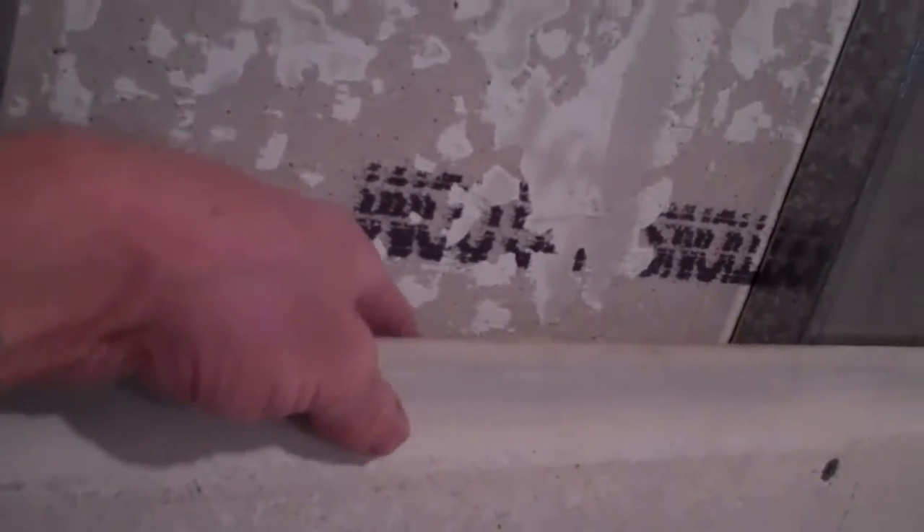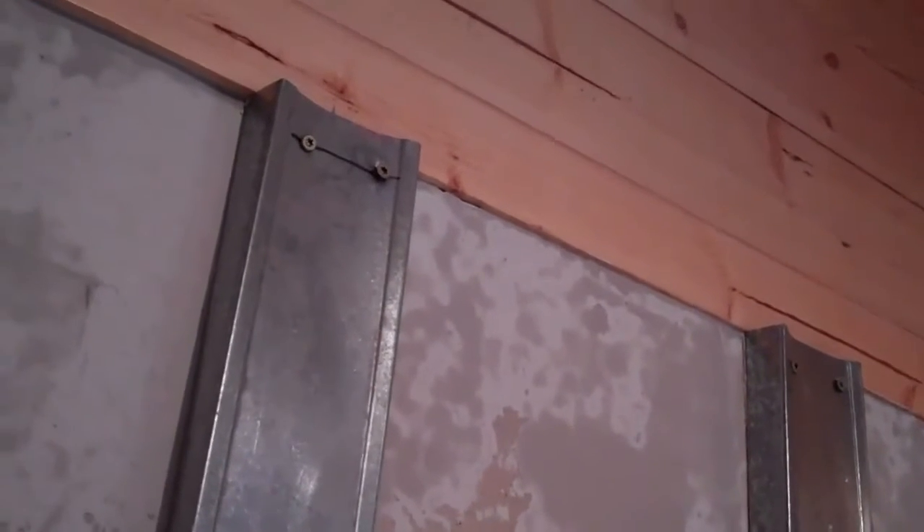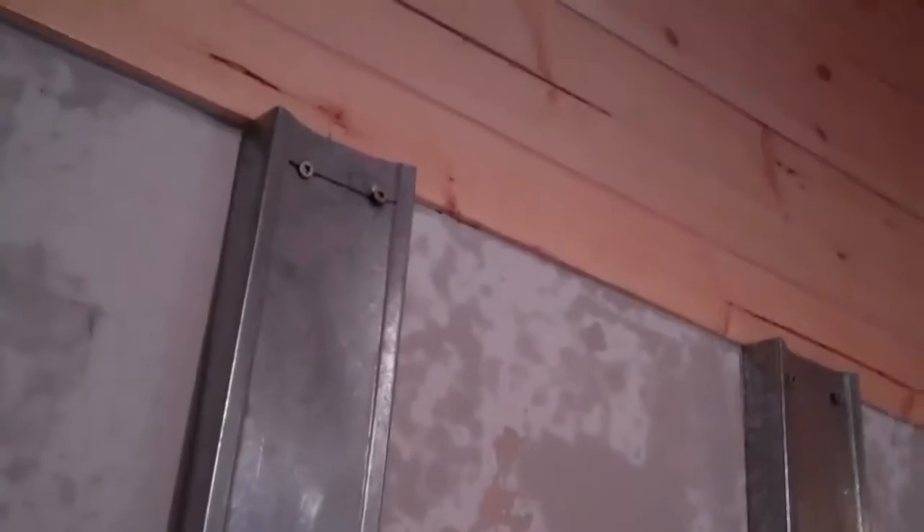You've got an inch-and-a-quarter airflow here that continues all the way up and then exhausts safely. The main thing to understand is you cannot put wood next to heat — that's why we're using metal studs and a metal wall. This will have hardy board on it with ceramic tile, so it'll be a nice little cubby hole. It's open at the top; there's a ceiling fan here. You could not normally do what I'm doing if you don't have an open ceiling to move the air — there's a loft up above, so this area will act as a chimney and the heat will naturally go up.